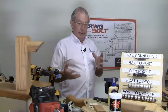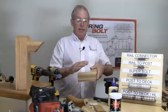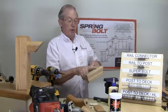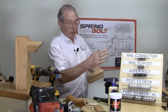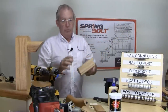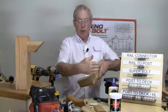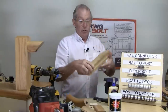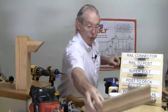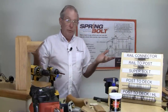So there's your rail connector — for your butt joints, your 90-degree joints, and it'll work on anything in between. If you're going to jog around a wall and do a 22-and-a-half and a 22-and-a-half combination, this hardware works on that as well. It'll work on a 90 or a butt joint and anything in between. It installs high up in the profile so you can drill a baluster right on the joint. That all works with Titebond 2 or Titebond 3 if you're working outside.